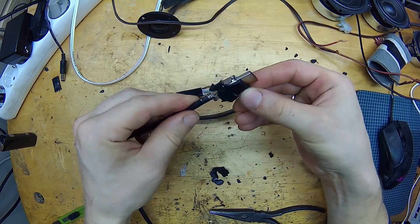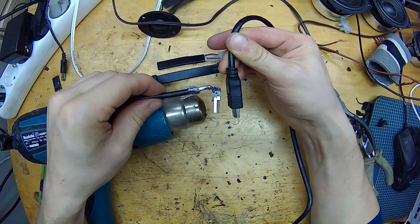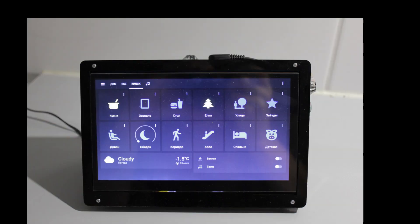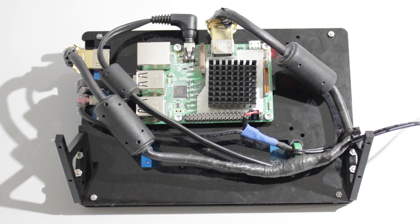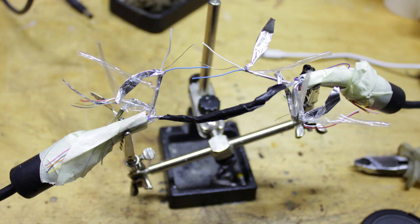Anyways, let's deal with those connectors. I don't want to spend any additional money buying fancy connectors for this build, so I took a working HDMI cable, stripped those connectors to the bare minimum, and carefully bent the wires. I did a similar modification with the micro USB connectors, and like that I reduced the overall size of this thing a lot. Here it is before, and this is after. I also had to make this HDMI cable shorter — that was a three hour hassle and I wasted two cables doing that job. So if you have money to spare, just buy a cable.